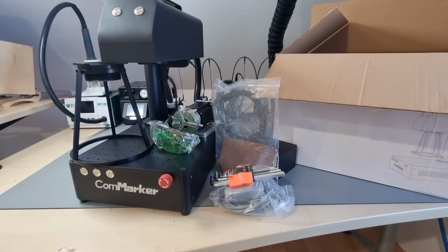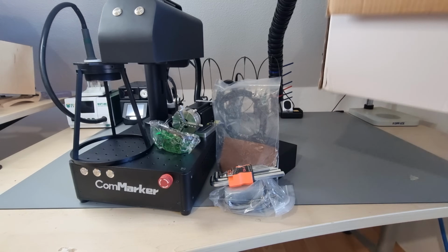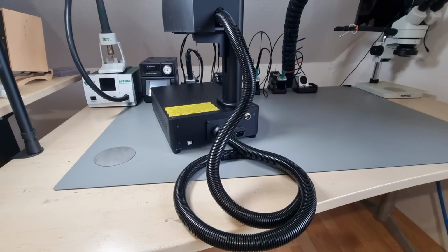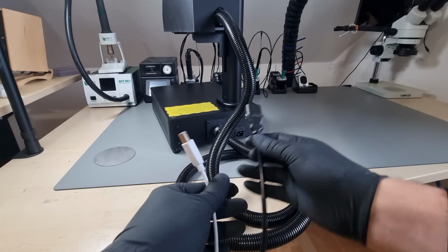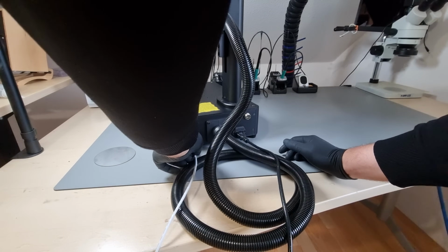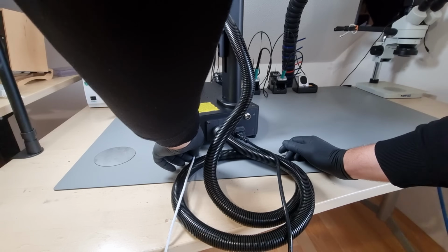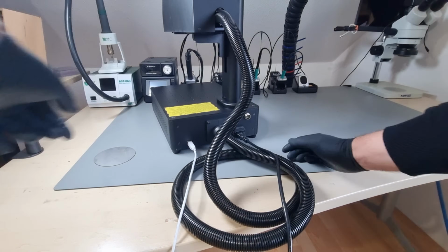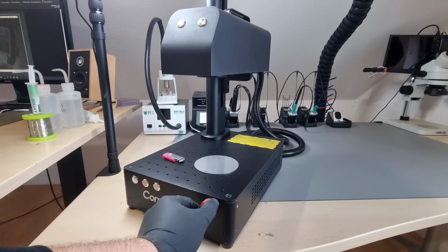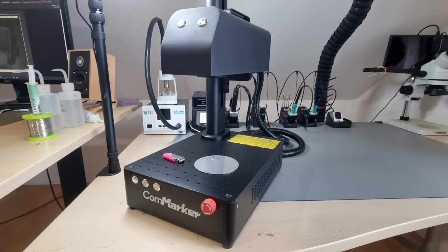It also came with a motorized 4th axis, which admittedly feels very nice. A focus aid for hand-holding the thing. Oh boy. And a foot switch, probably to help with semi-automatic mass production. The machine was delivered in 3 parts. The foundation, the Z-axis and the head. Those had to be assembled with 8 fasteners, and I had to flip a switch on the internal power supply, because it was set to USA voltage. And that is all the preparation that was required.